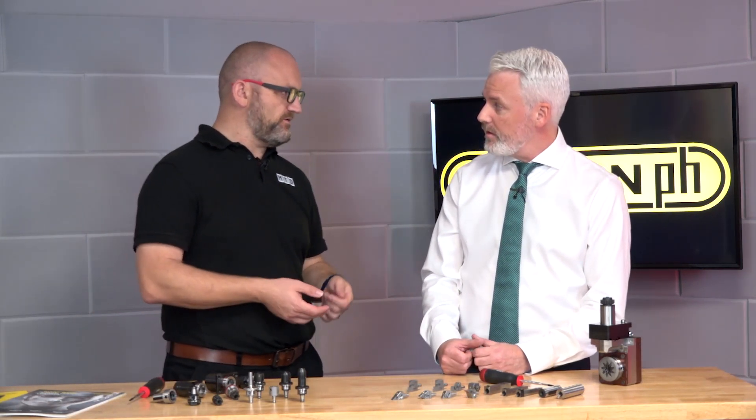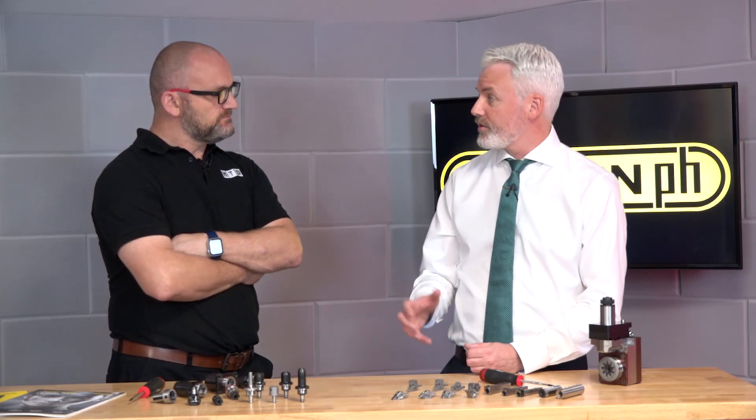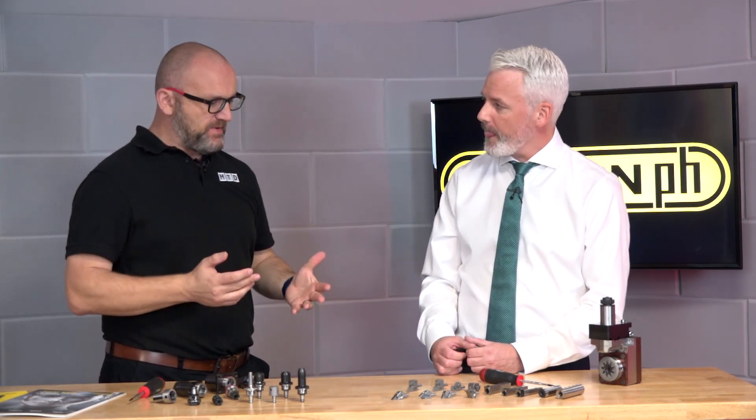You could have double cassettes - if time was of the essence you're talking five seconds. You could have a sister tool set up already ready to go, preset with your offset, put it straight in, change your offset and off you go straight away.